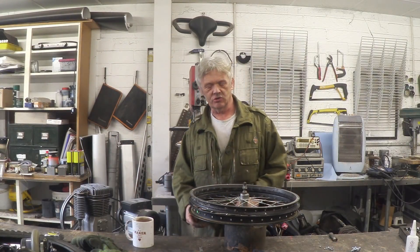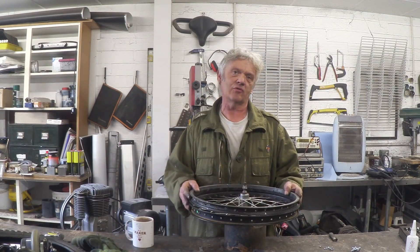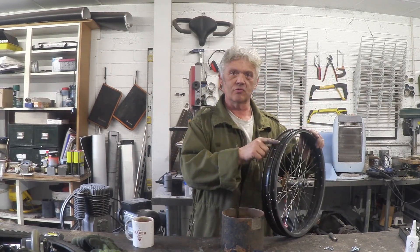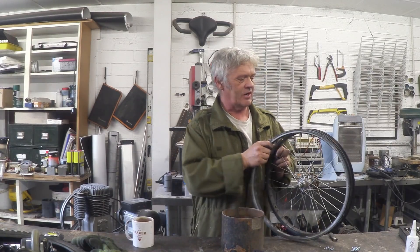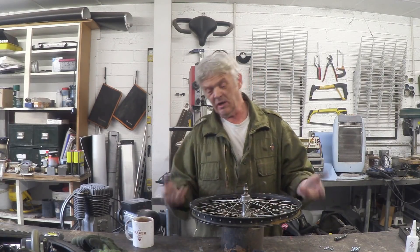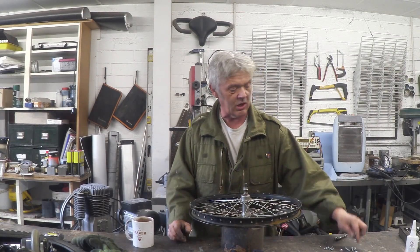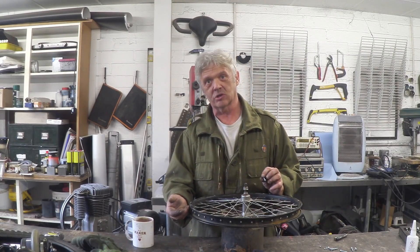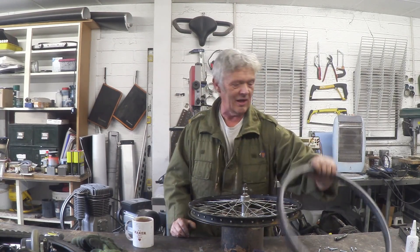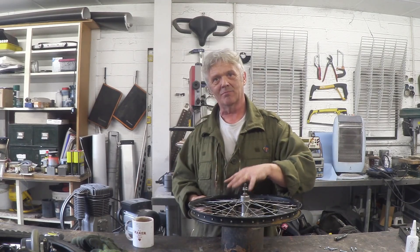Like anything, there's always a couple of ways you can do something. I could have welded this wheel onto the other rim, but I decided instead to bolt it. What I did was super glue them together and then drill all the way through so the holes line up. I put a mark on there so I can line them up and then separate them. Then I put a load of bolts through — I'm going to put six bolts on. If it's not enough I can add more. This side is where the tire goes back on, so the bolt heads are rounded and the tire presses against them so it won't wear through. On the other side I'm going to fill it with resin so a bolt sticking through doesn't matter.